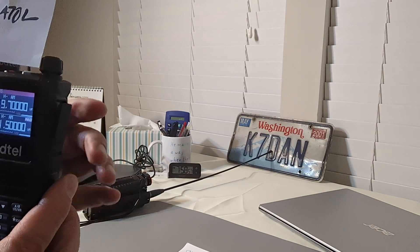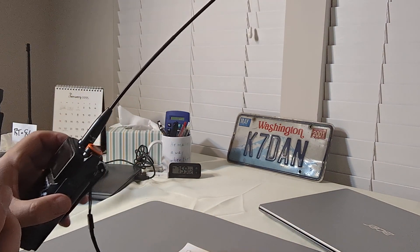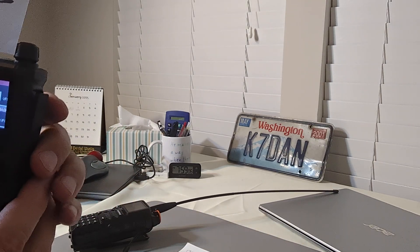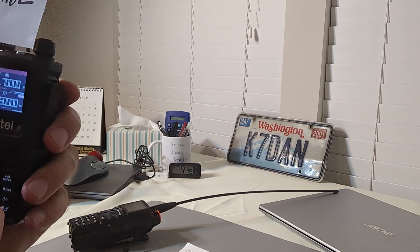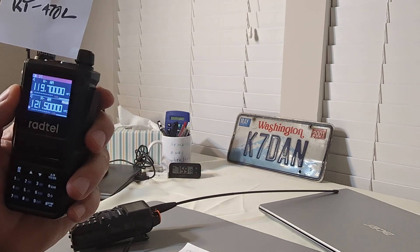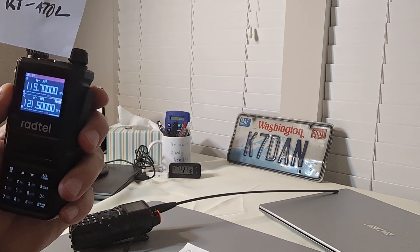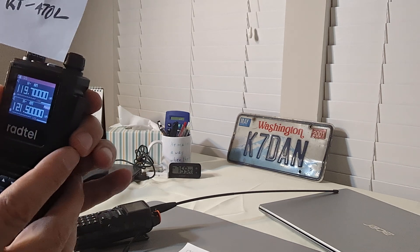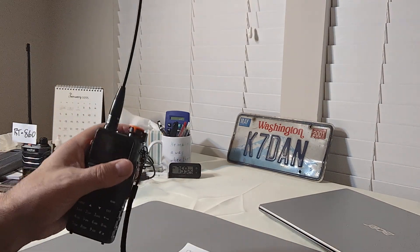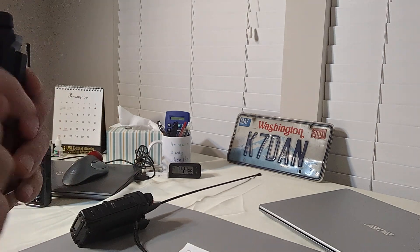I'll include an Amazon link for the airband antenna designed for the airband, which can be used easily with this radio or other radios with the airband that have an SMA connector. I recommend it. It's about the same as the tri-band antennas I've tried. For ham radio, we have tri-band antennas for 2 meters, 220, and 440 MHz, and they work pretty well also on the airband. So if you're a ham and want this radio not just for airband but also to transmit on those bands with a ham license, you'll want one of those tri-band antennas.